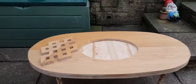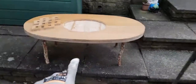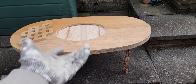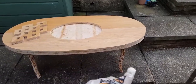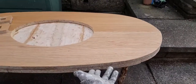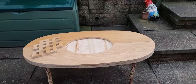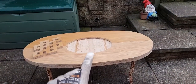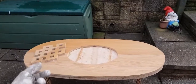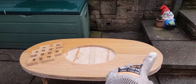Look at that — oh my goodness. So this is how far the coffee table has come. What I did last time was I had the pieces all separately — I had the legs. All I did since then was attach the legs to that piece and that piece, and I stuck it all together upside down on plastic sheeting inside where I was sure there was flat ground. And since then I clamped the ends to make sure they were flat, because at the ends they wanted to be uneven where they were glued together.